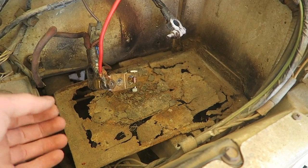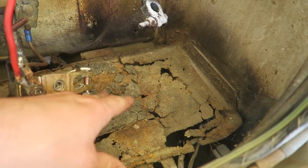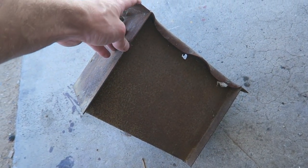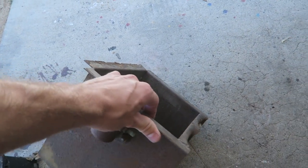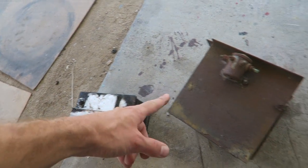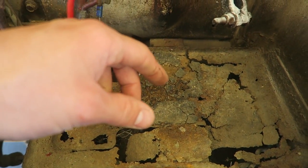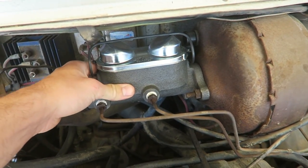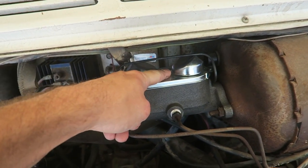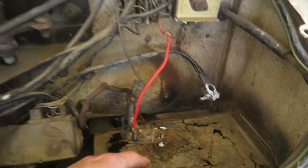Now I'm going to be working on the battery trays. You can see this battery tray is eaten up by rust and it's completely destroyed. Usually happens on all older cars because the battery's been sitting there and leaking battery acid all over it. So I'm going to go ahead and replace that with this one, which is actually rusty as well but it's not bad. This came off the back of it and was an extra battery storage for the rear. I'm going to go ahead and probably chop it maybe halfway, put that in there, weld it up in place - probably make it removable. I also installed this brake master off camera and it worked fine, but then the other day I hopped in it and the front brakes were locked up. Ended up I had too much brake fluid in there - that was the only issue, which is kind of weird. I did tap some stuff with a hammer just in case it freed something up. So yeah, let's get to working on this.